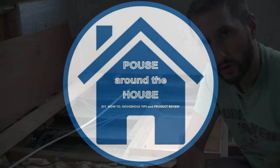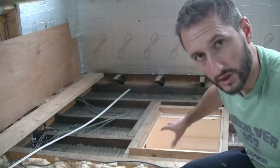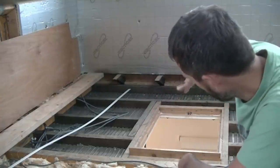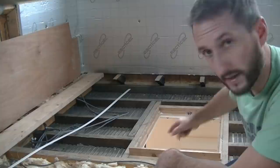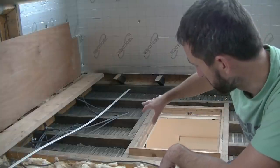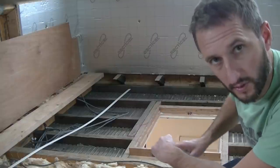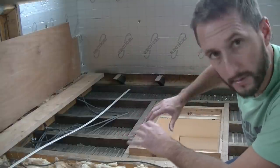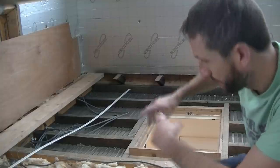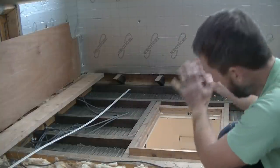We've just put a few sheets downstairs. We're upstairs in the loft — there's the loft hatch — and basically I've got to cut an L-shape out of this loft hatch. I've got some plasterboard supports downstairs holding up this bit of ceiling, so that when we cut through some of these old joists, the ceiling doesn't fall down. Once I get some new posts and joists in place, I'll be able to support that section of ceiling.